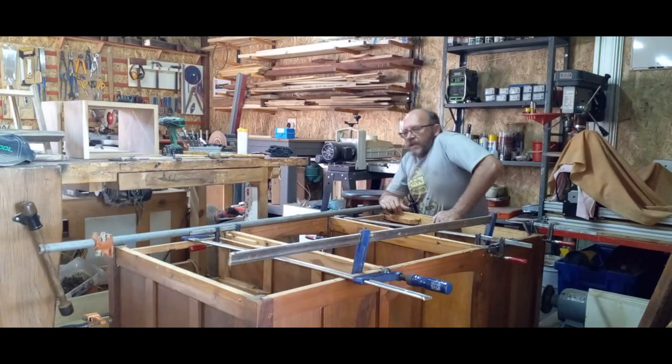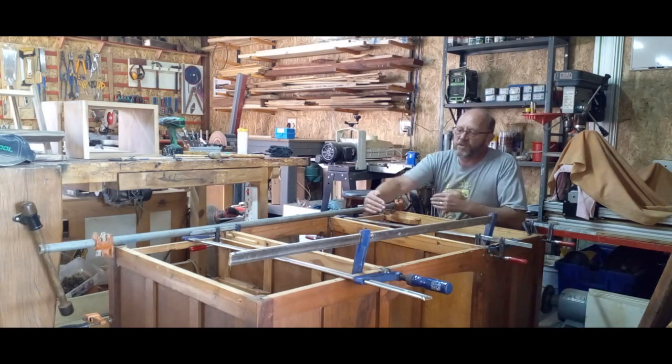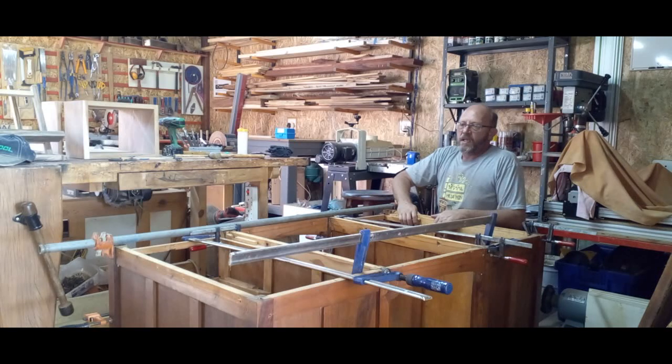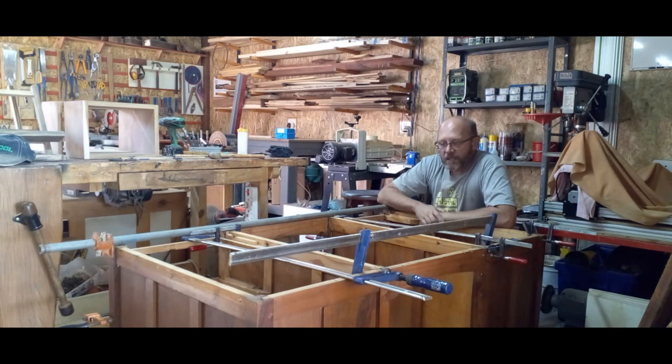So guys, this is definitely one of those times where you thank yourself for buying those extra few clamps. I'm almost out of clamps. Still got a few left, but for most of the top joints I've treated these 2 boxes as 2 single boxes. Just glued up their joints first, top and bottoms, and then I combined the 2 again with the braces, top and bottom. At the moment it feels very, very nice, strong in the clamps. So I'll leave it now to dry a bit. Then as I remove the clamps, I will put some dowels in, just for some extra insurance. Then we'll start sanding and cleaning and make it something beautiful again.